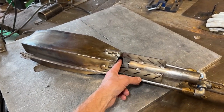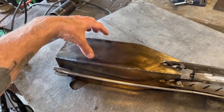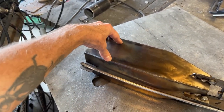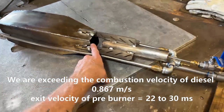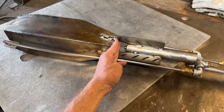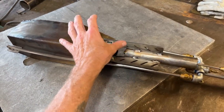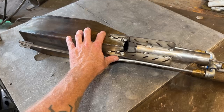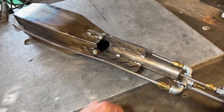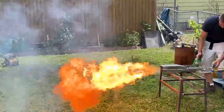This blast of air is pulling so much secondary air into this pre-burner that we are acting more like a pump than a pre-burner. I want to reduce the air input. We could do that two ways: we could move this forward, which reduces the efficiency of the air horn or the ejector effect, or we can put a restrictor plate in here with a hole about the size of a quarter — that's what I'm thinking.